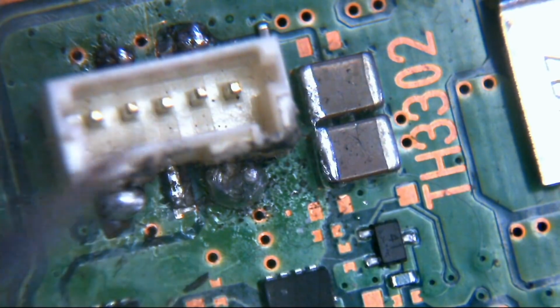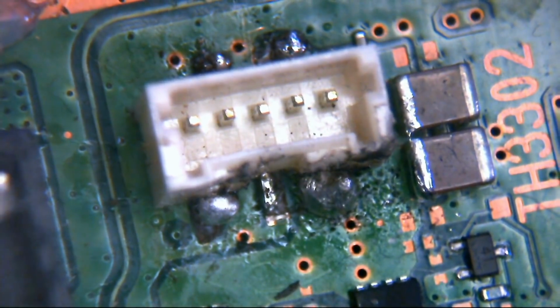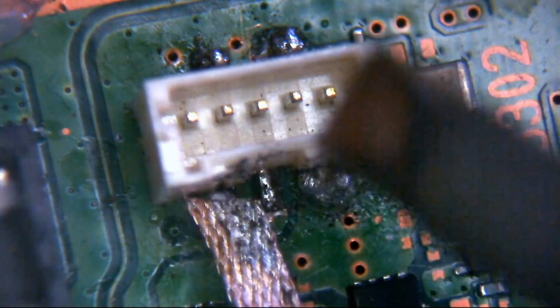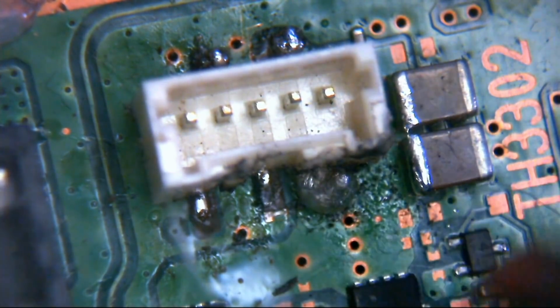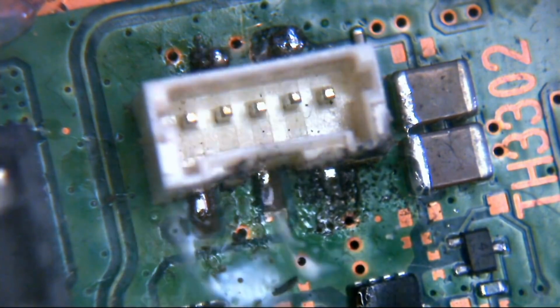Okie doke. So, now the big problem I have here is not knowing what's underneath there. So, are there any pads intact or not? Just going to try and get you a little bit more centralised. There's a glare from the outside window on the monitor, which is really useful because that means I can't see what you can see very easily anyway. So we're just going to come in here with a bit of braid. And as you can see, just off that one pin there, there's quite a bit of tin come off there, so there's quite a little bit too much solder on there, to be fair, but that's okay. We can clean that up, get the contacts looking somewhat normal again. Again, there, as you can see, it's flooded the end of my braid there.